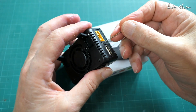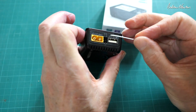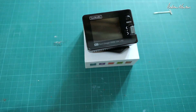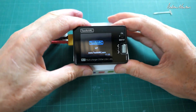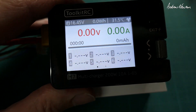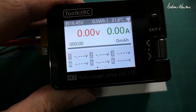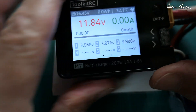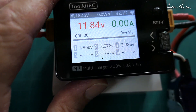The signal ports need this cover removed — there we have signal in and signal out. I'll show you more about that. Let's plug the battery in — a 4S battery going in. The first screen shows the power input current, temperature, voltage, and the voltage of each cell. Now let's plug in a partially discharged battery via XT60 and balance lead. That shows us the voltage of each cell, overall voltage, and the charging current.